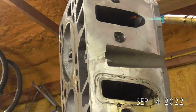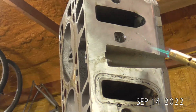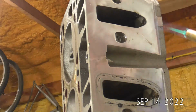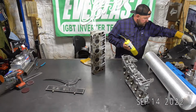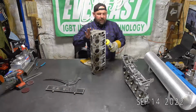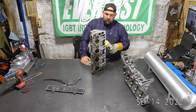Gaming Ham, is it necessary to preheat everything every time? No, with my 325, I've got enough amperage. I could hit this cold. That's not a problem at all. With 325 amps, I've got enough amperage to start hitting this thing. Mainly the reason I'm preheating this is more to just get the water out of it. Just dry it out, chase the moisture out.